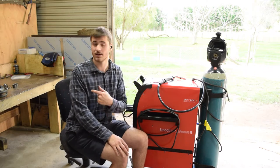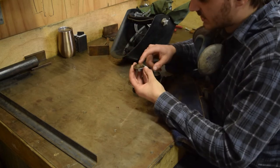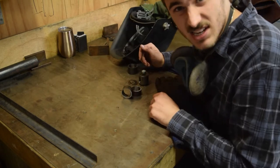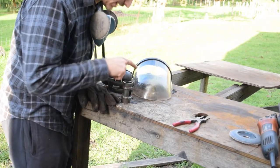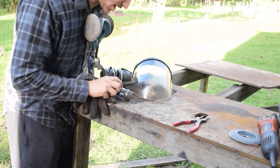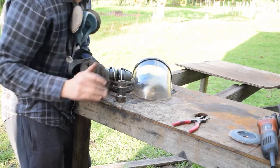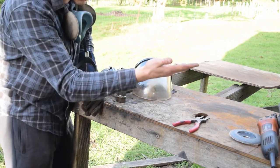Still learning how to set it up, so don't judge me too harshly. What we're doing now is just welding everything together. This is the little sandwich plate that's going to have a captive nut — it just needs to be welded on the back before we join everything together, otherwise the thread would just come out. These are the little cups that will hold the leather and the copper. The welds went fantastic — got penetration all the way through at least four mils. Now the welds look terrible. If I wanted nicer welds I should have V'd this out so I could lay the MIG bead in there a bit more flush, better wetting out. But it wasn't fully necessary for this job, so I'll just use the grinder and clean this up.